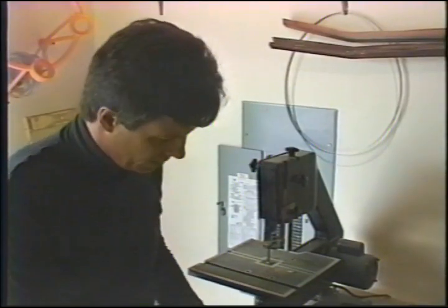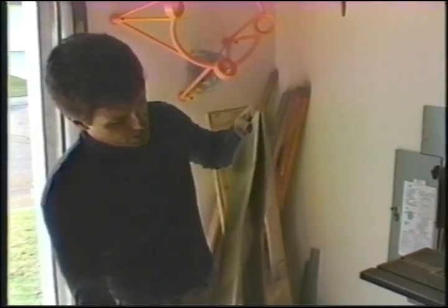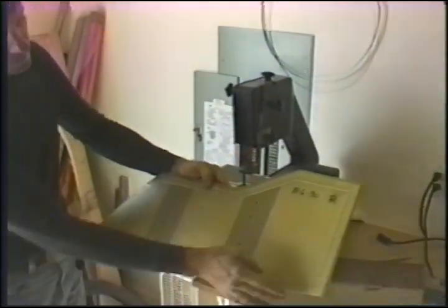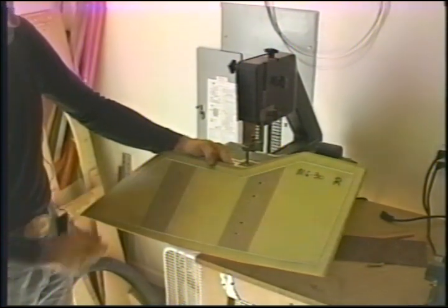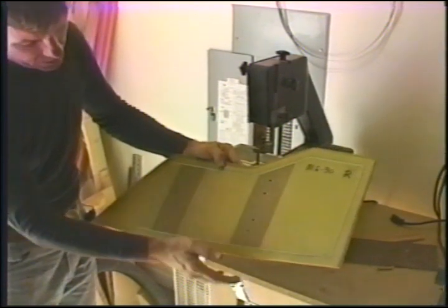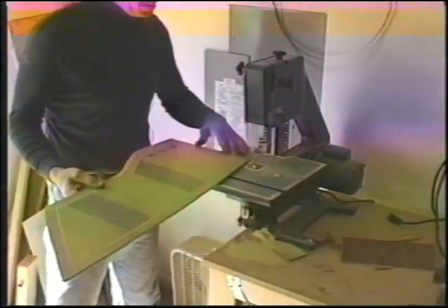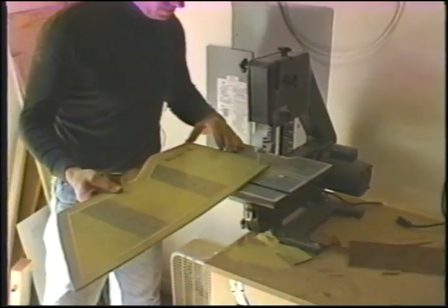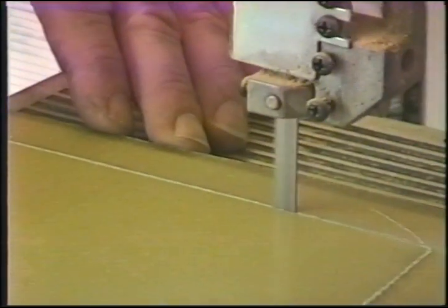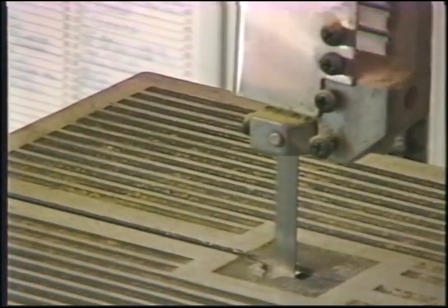All right, here's our MG30s. You have two of them. This is the bagged back side of the right and the left MG30. This is the right MG30. The scribe line is done off of a 1/4 inch thick aluminum plate, match drilled, and all you've got to do is attempt to cut, since it is a groove, cut halfway into that line and leave the inboard surface of the mark. Just do something like that on the rest of it. You can actually see the remainder of the scribe line on the inside edge.